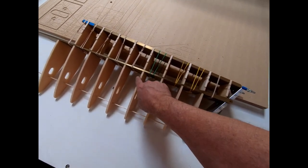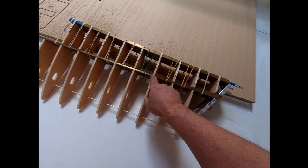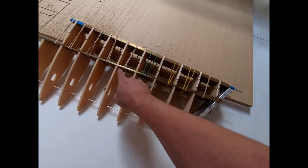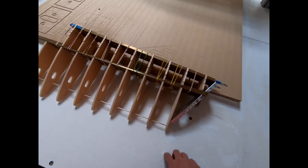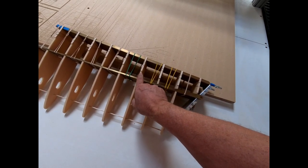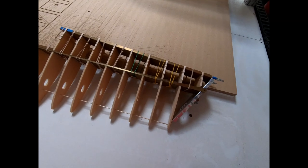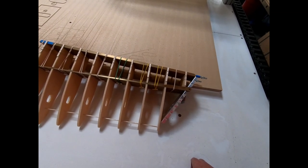The other thing we have to do before we put the skin on is fill in between each one of these ribs with about a millimeter-thick piece of the rib material that needs to get glued down on top of the spar here. That needs to be done and sanded to the profile here, because these ribs actually stick out just a little bit, and you're not supposed to glue the skin directly to the spar itself. You're supposed to have a thin layer of the foam in between. But yeah, we'll let this sit overnight, and we should have that glued in.